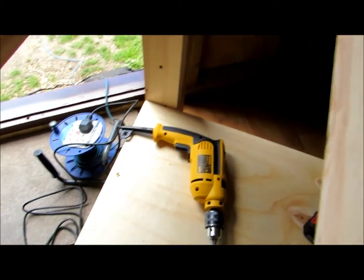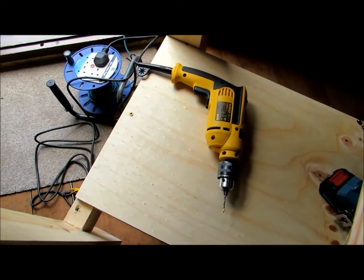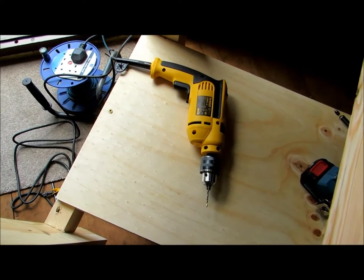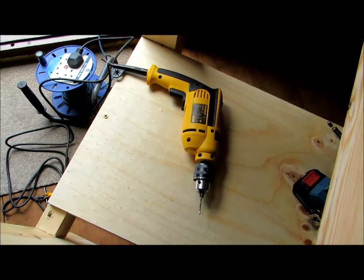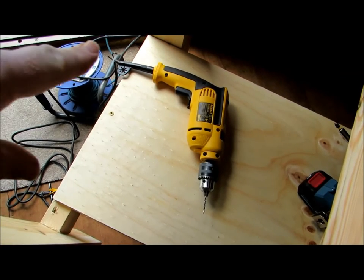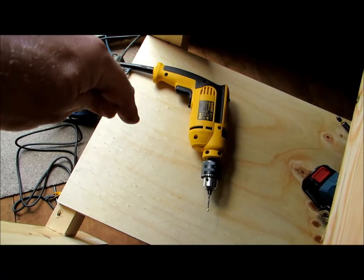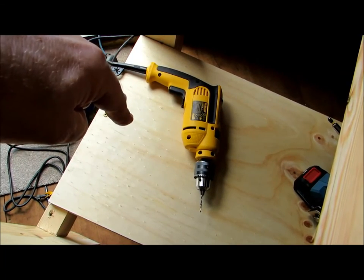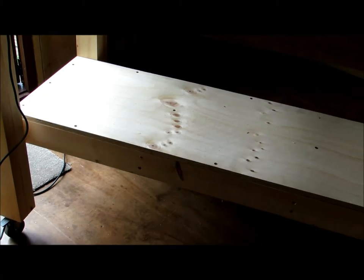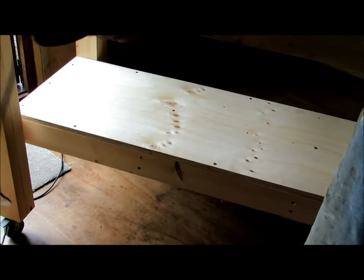It's important to get the first screw in right because you're securing that piece of wood exactly where you want it, but it's even more important to get the second screw right. So I've put that one in and screwed it in place temporarily while I drill the hole for the other one and countersink it. I can come back to that one a little bit later because if you have one screw in, the whole thing can swivel around around the axis - if you have two it's not going to swivel. So that's on nice and solid.